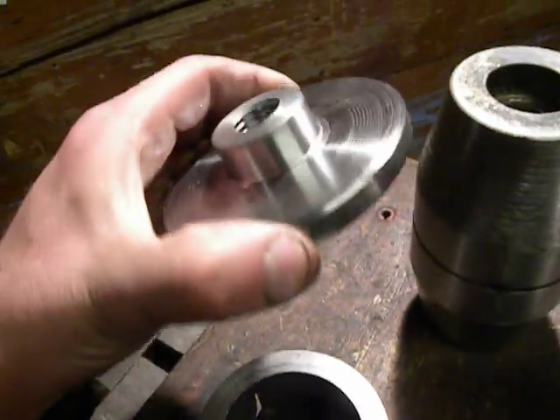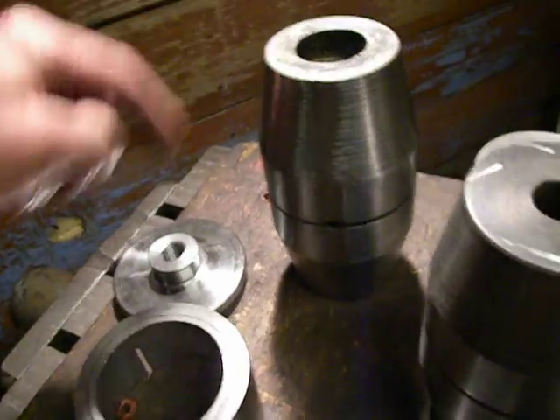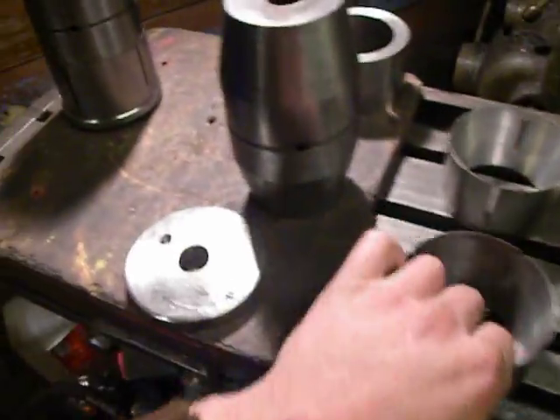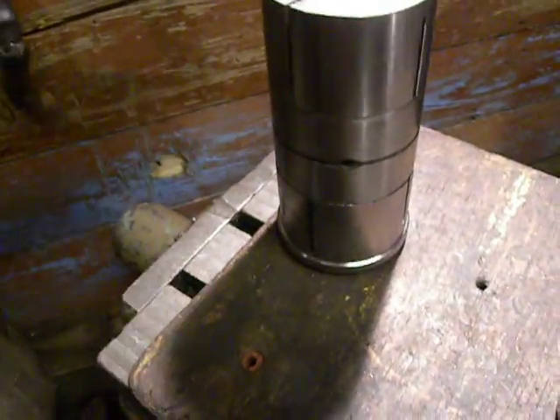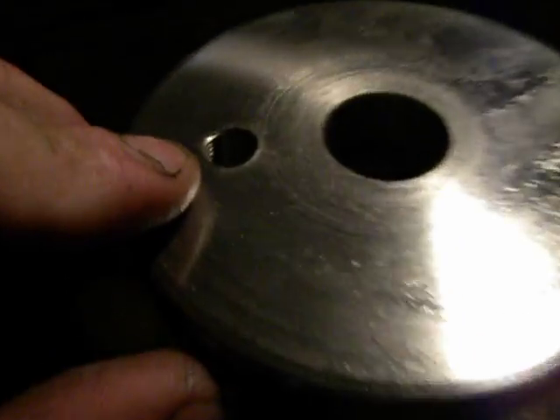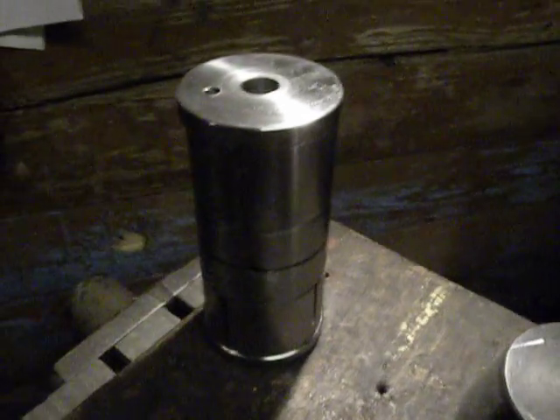Here I make a place for this plate. I hope you can see the threads right here, so this will be the bottom — like so, like so. Then from the top, add another washer and another plate with a hole, where also there is a thread, and here will be screwed in a grease nipple.